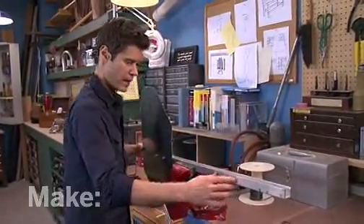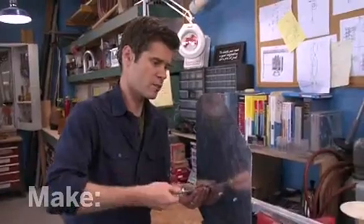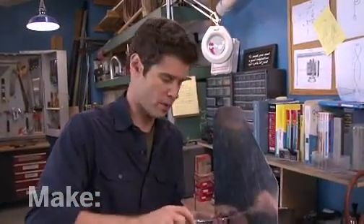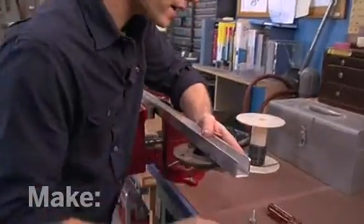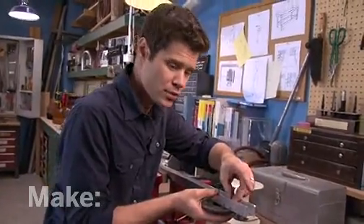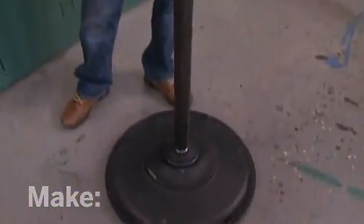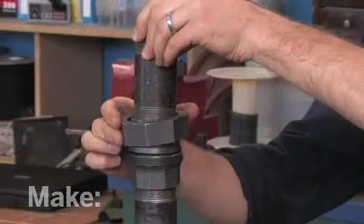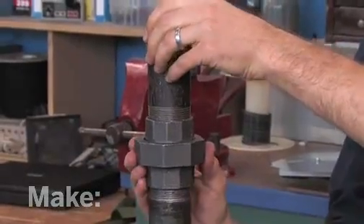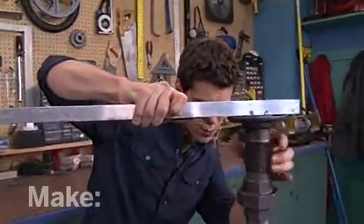We need to put the generator on a frame that can point into the wind, so I've built one out of channel aluminum and attached a tail made from sheet metal — cut out with tin snips. Watch out for sharp corners and edges; you can deburr those with a file. The whole frame sits on a pipe flange — that's where it pivots — attached using a bolt, washer, and nut. We'll mount the wind generator on a piece of one-and-a-half-inch pipe. So the frame can spin freely in the wind, I'm attaching it to a pipe union, leaving it just a little bit loose so that it spins freely.